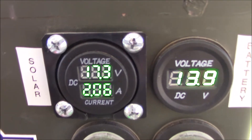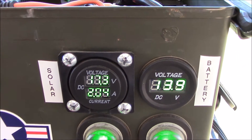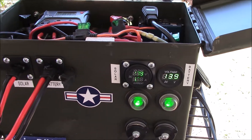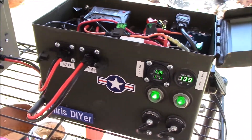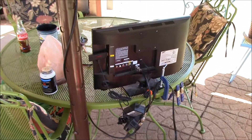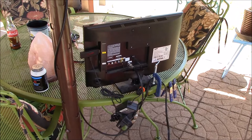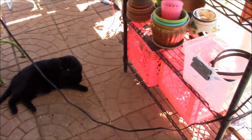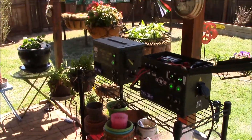As you can see here, I've got a couple of amps coming in, but I'm already in float. The reason why I did this paralleling cable SAE jack modification was I was having too much of a voltage drop with the 12-volt power socket jumper cable deal I had in there. So now I've only got like a 0.1-volt drop and loving it. It's kind of like using a thin straw versus a garden hose.